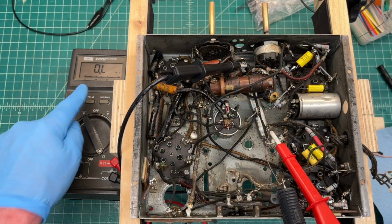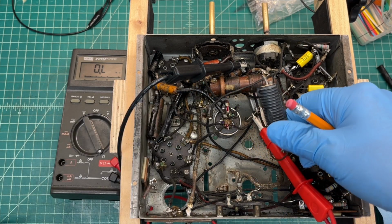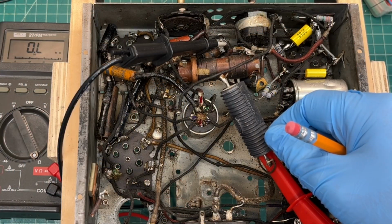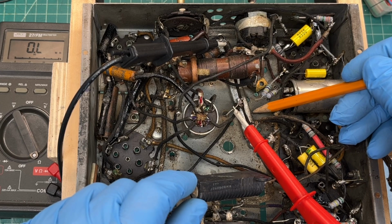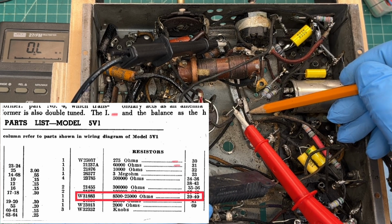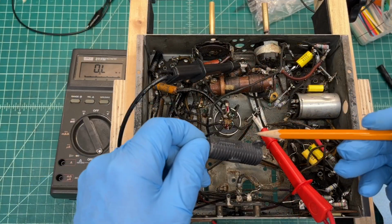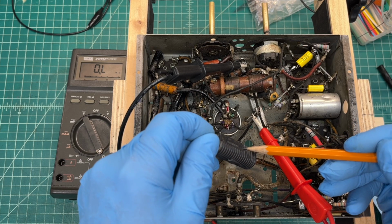It's open, as you can see, and if you guys recall, the one section was bypassed with this resistor. And if you look at the schematic, the section that was bypassed was the small section here. It's number 39 on the schematic that I'll reference. Should be 8.5K. And then section number 40 is 25K. Anyway, this power resistor that somebody put in is 2.5K.